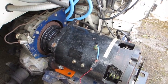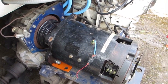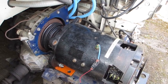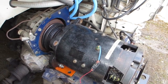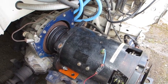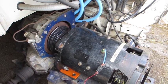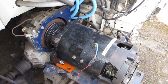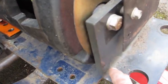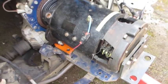What I ended up doing was putting the DC motor here instead of the AC motor — this is going to run from DC. The tough part was getting the clutch assembly off the old AC motor and mounted onto the DC motor because the shafts were of different sizes. I'll have to turn this bracket backwards so that it'll fit on the shelf I made for the original motor.